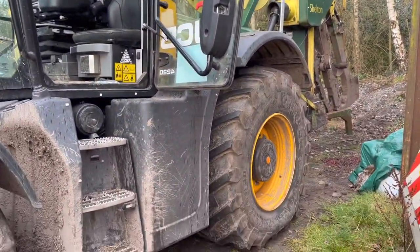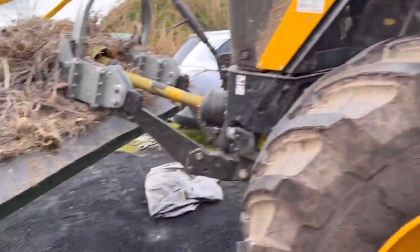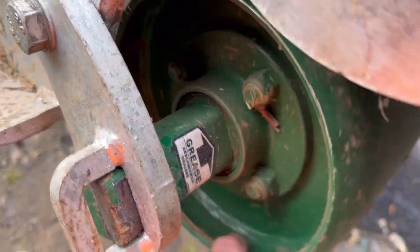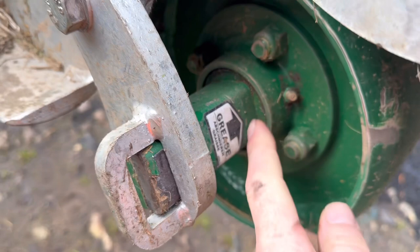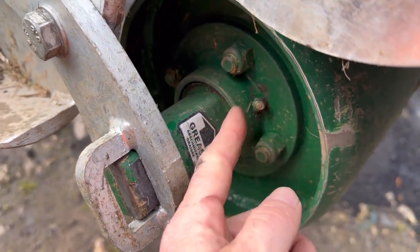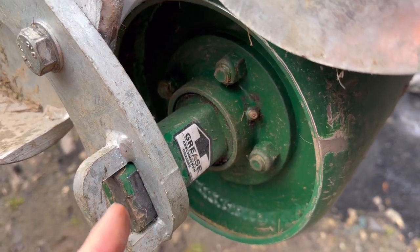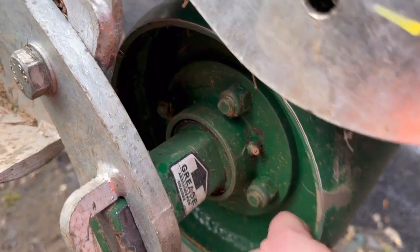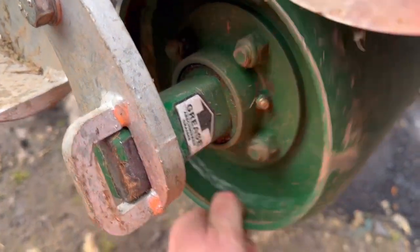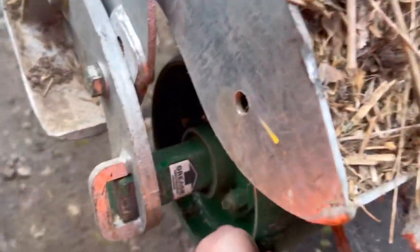Got the drainer on now - you can tell the tires are a bit soft. Taking it up to the workshop. Looking at this bearing housing - it turns rather than the centre shaft turning, so apparently you don't get string wrapped into the bearing. Normally the shaft in the middle of the roller turns and string winds itself into the bearing, but because the bearing housing turns instead of the centre, it doesn't get string wrapped in it. Just looks a bit weird, never really noticed it.